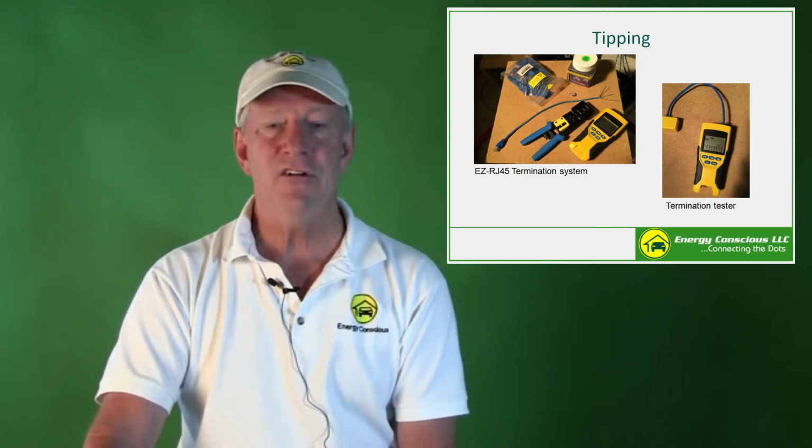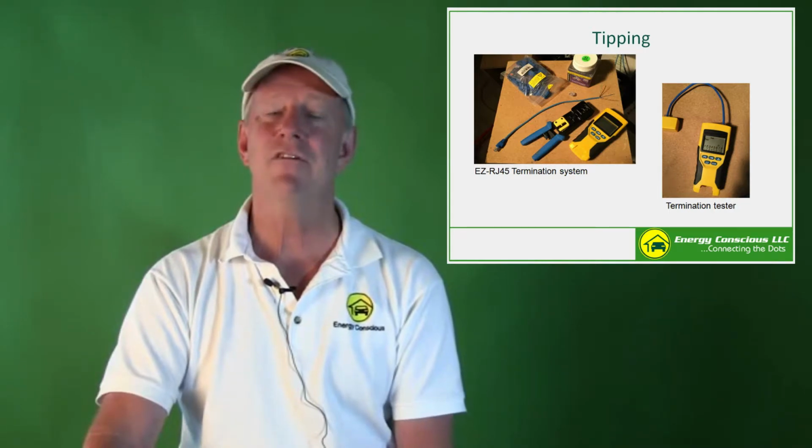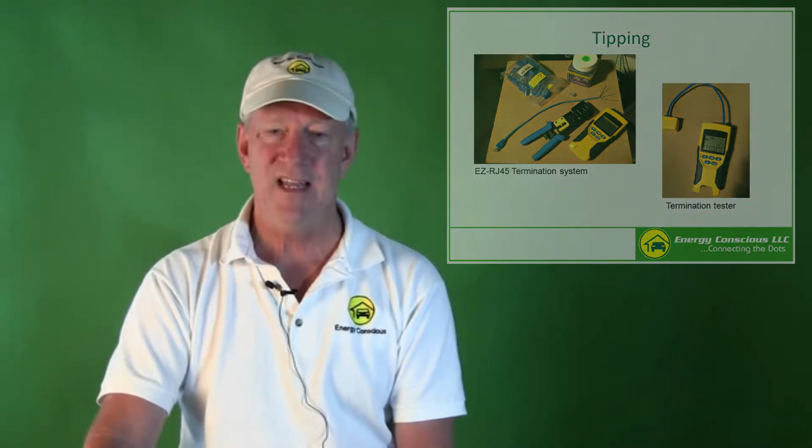We also used a cable tester to check for a successful termination. And although we used it quite extensively in the early going, once we got good with the tipping, we were able to use it just for ringing out circuits or finding out which one was a bad termination. Once everything's tipped, just plug it all in and you're good to go.